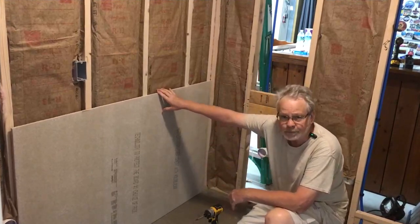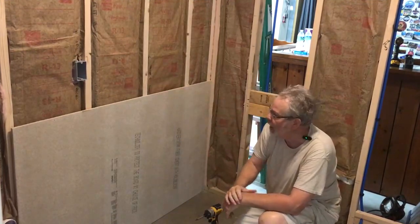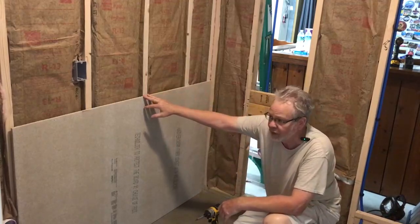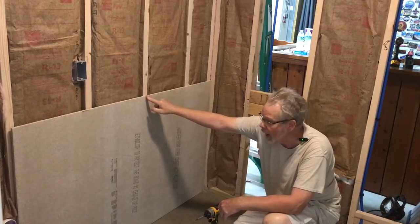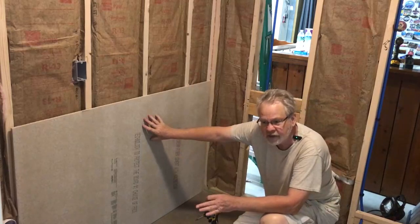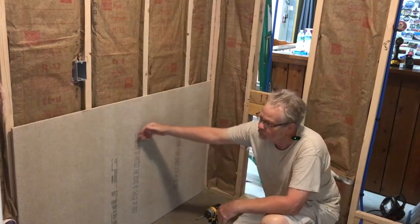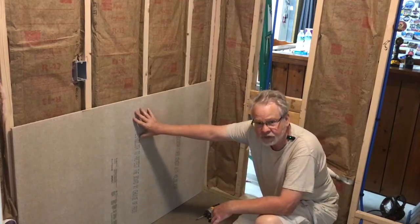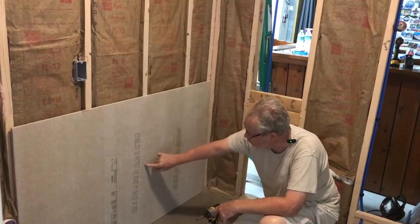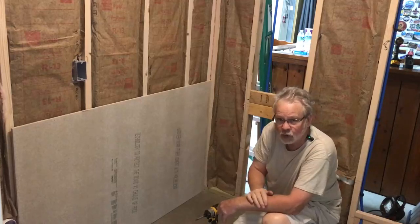We're getting ready to put up our hardy backer. In this bathroom we're going to have three tiles high — each tile is about 13 inches — so we're looking at approximately 39 inches when finished. The hardy backer is 36 inches, so it will actually overlap the drywall about three inches at the top, giving us a nice transition without worrying about the seam. I like using hardy backer for two reasons: tile adheres very well to it, and it's a lot more rigid than drywall so if someone bumps the wall you don't have to worry about busting a tile, tiles popping loose, or cracking a grout joint. When attaching it, go about every eight inches and stay away from corners — go down about two inches before putting a screw because it will bust the corner off fairly easily.